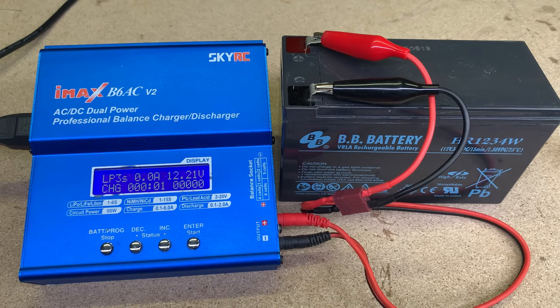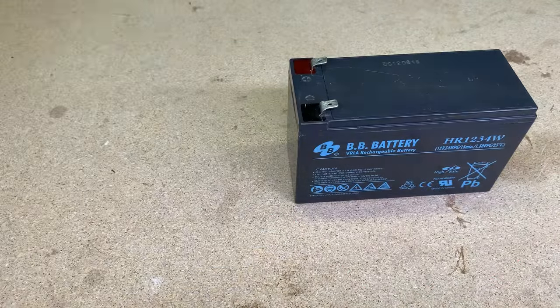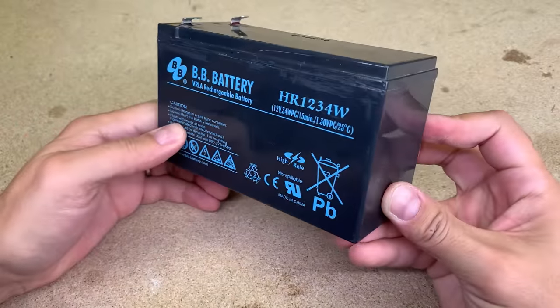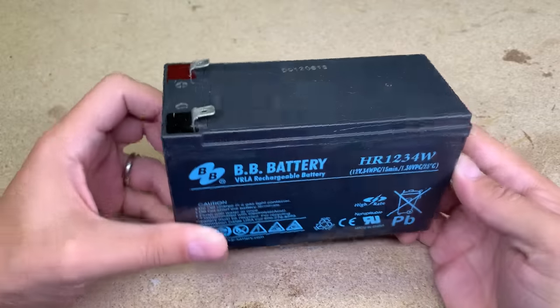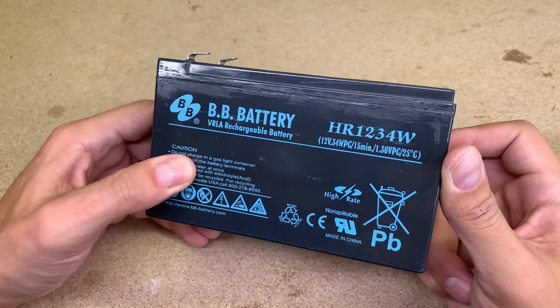At the moment, this battery could give up to 40 amps of continuous and 60 amps of peak current for any 12-volt device, because that's the BMS limitation. In case you need more, there is an option to bypass the BMS module and connect directly to the battery terminals through a fuse for safety reasons. In that case, the maximum discharge current of this battery pack will be pushed up to a stunning 154 amps.